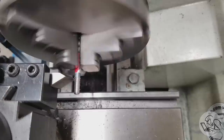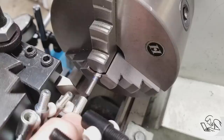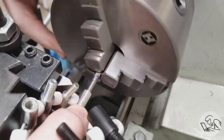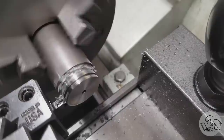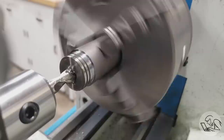On to the piston rod, made from stainless bar stock. I single-point cut the thread since it was tough stuff — difficult to get a die on there. I used a thread checker as a go/no-go gauge. The piston is a very iconic, cool part turned from steel bar stock. I ground a special grooving tool for cutting the grooves for the piston rings — the rings are Teflon and come in the kit. The end needs a counterbore for the retaining nut, made with a two-flute center-cutting end mill — what the Brits call a slot drill.